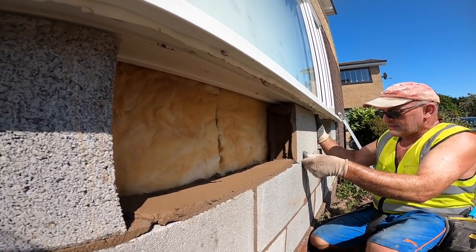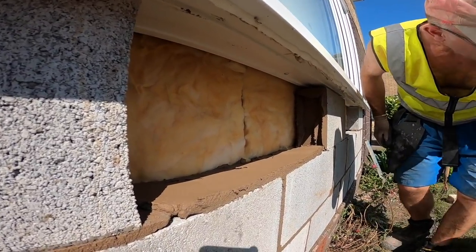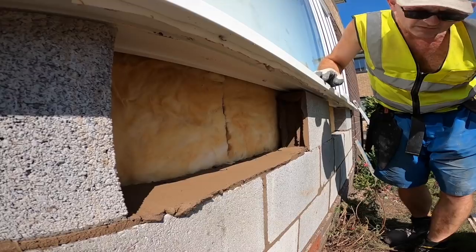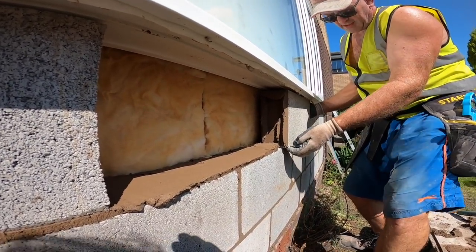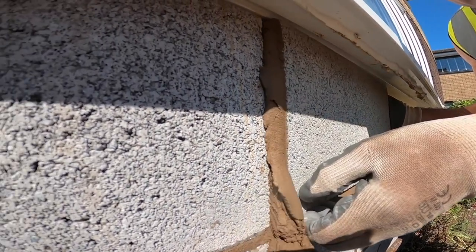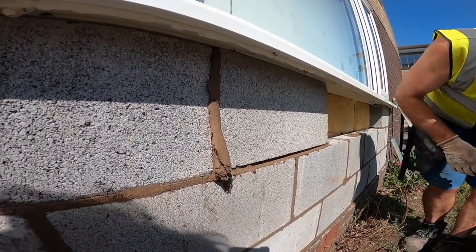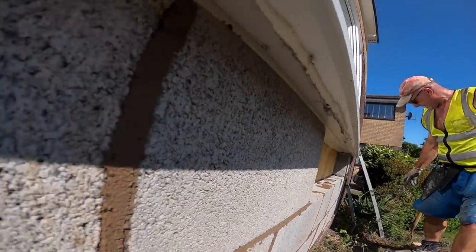They get a lot heavier when they're in awkward situations, aren't they? Yeah. So, bed's ready. You don't have to be perfect, it's getting rendered, but just get the gap as small as possible. So there's our bed. So get all your block, get your finger under this edge, lift it up tight against the plastic, slide it in. The last one's going to be the difficult one. So, you show them how small the gap is. Barely, can't even get a finger under it.